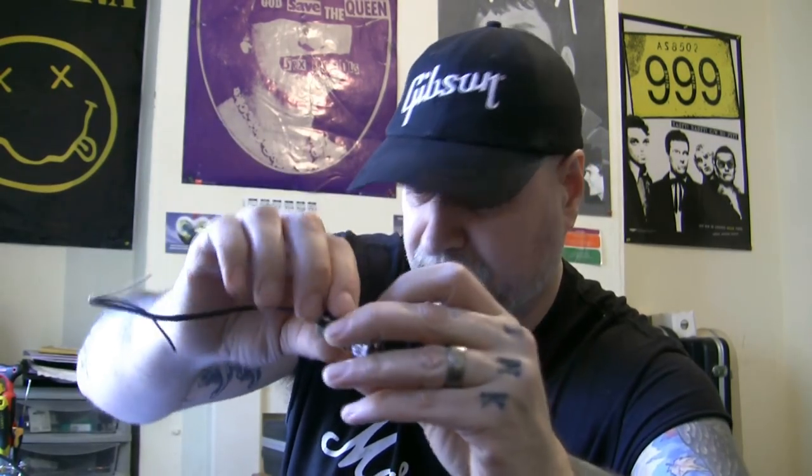I didn't just get the paint with the package. I got a whole kit, so it gave me two pieces of wire which you use to conduct certain parts. I won't need that. I have spools of electrical wire for guitar work. They also send two lengths of shrink wrap tubing for your input jack, which I've already done, showed you yesterday I believe. Mine's already done. I've earthed all that, shielded all that, and I've also shielded the whole length of the wire, so I won't need that. Then you get a little bit of copper tape to shield from the side of the wall to the top of the control plate, this kind of scenario.